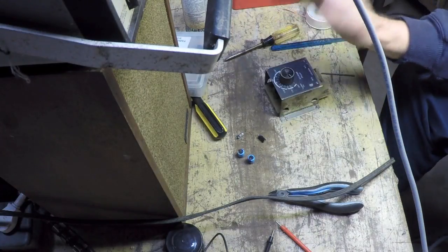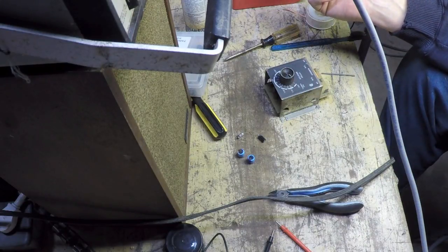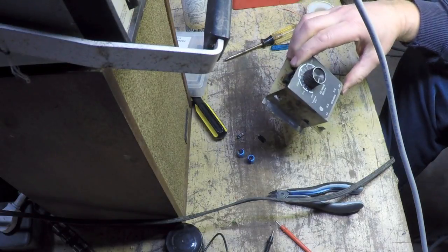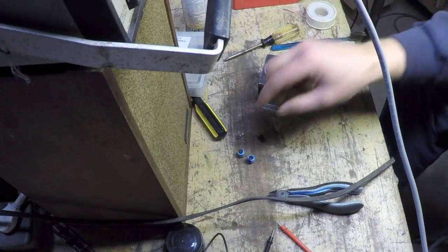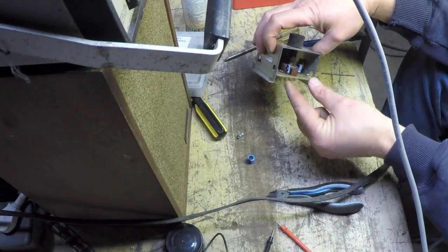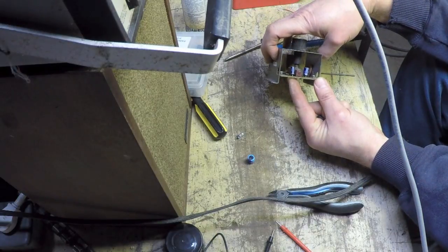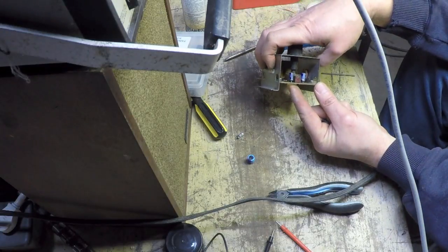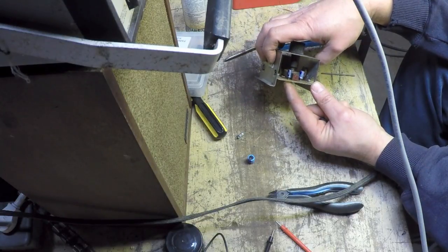So I had a couple of TV chassis, and although those TV chassis are pretty old, they're actually still newer than this PC board. This PC board was probably manufactured in the 70s by the looks of it. It's interesting, I just want to show before I finish. I've already got two caps installed. I found the 3.3 microfarad in a TV chassis. Boy, that's really old school, a PC board from a CRT TV set, to give you an idea on the age.